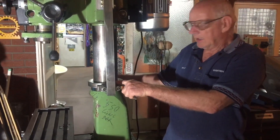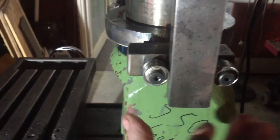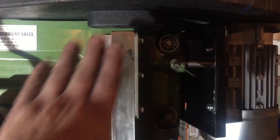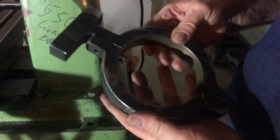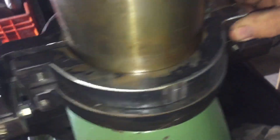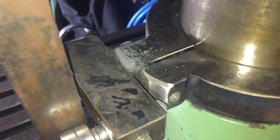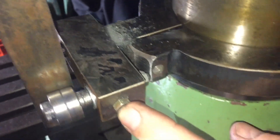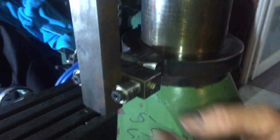So we've got a two-piece arrangement that clamps on. The groove here goes over the rack and locks into place. On the other side we can make whatever arrangement we want. What we've done here is with two sets of bearings, one either side — so there's friction-free movement. We've got an adjustment: one of them is set, the other has adjustment via a grub screw here with a slot at the back, and that can slide it up. We should be putting these on the market, either as a kit or as drafted parts so that people can produce it themselves.